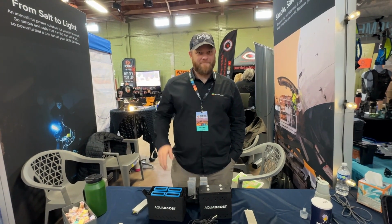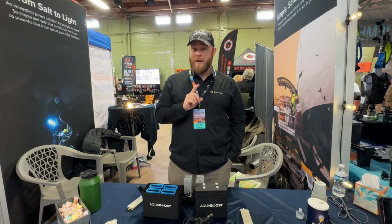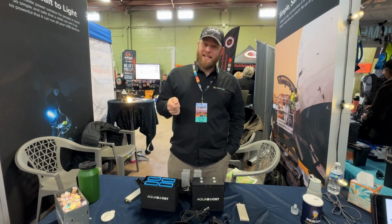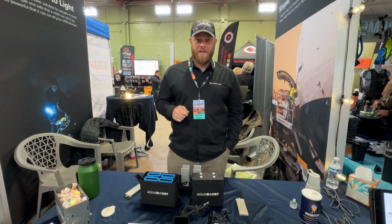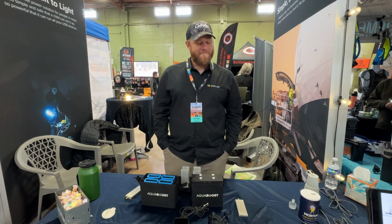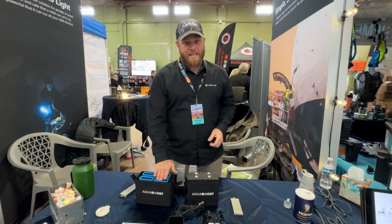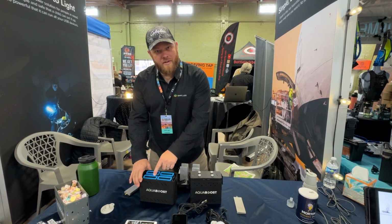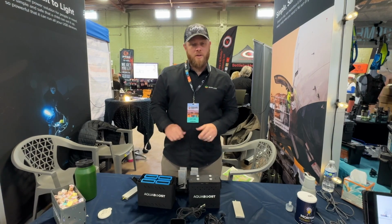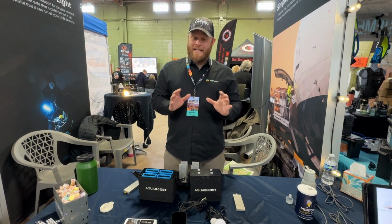Any salt. How about seawater? Seawater can be used. It's salty enough on its own to power lights, but it won't be salty enough to power phones. So we ask you to add more salt to give it the boost. So if you're at the Arctic Ocean, which is really not very much salt, you'd have to add even more. You would just do the full salt application, and how it works is we put 1 tablespoon of salt into each of the 4 cells and you fill it with about 200 milliliters of water. So in total it's 800 milliliters of water. Again, any kind of water and any kind of salt.